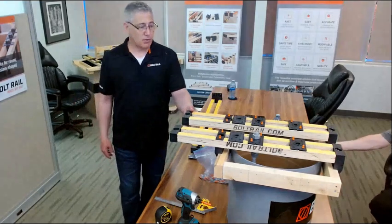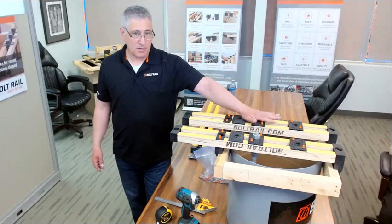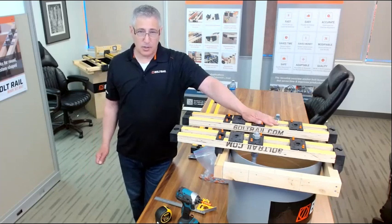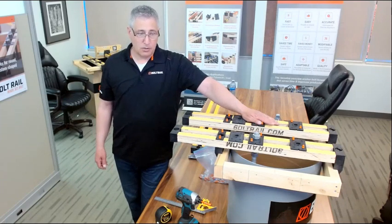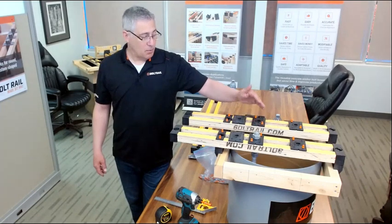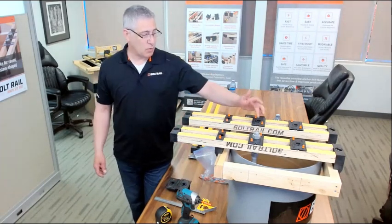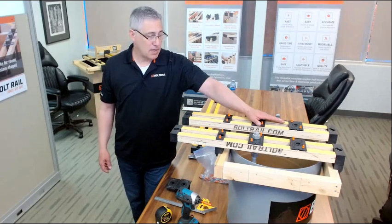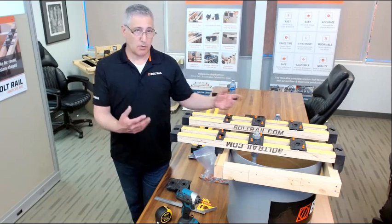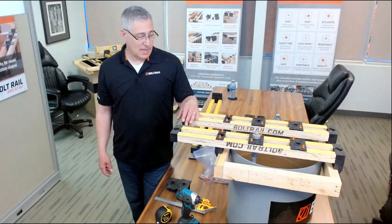It's easy to use, it's simple, it's fast, it's cost effective, it's great for quality control. One thing we didn't touch on: sometimes if you're building a template and you make an error in the construction of that anchor bolt template, oftentimes that template is not good anymore. You have to either start from scratch, or you're now planning on trying to fix your anchor bolts, or flame cut base plates, or maybe even redo your pile. One of the beautiful things about BoltRail is that it can be modified on site in minutes. When I'm doing my final quality control checks on my anchor bolt placement and we discover that something is out, it takes about 2 minutes to shift things around, undo things, and make a correction to the mistake. So the on-the-fly adjustability for quality control is really tremendous.